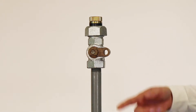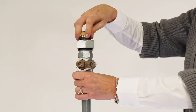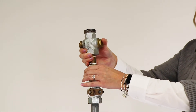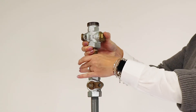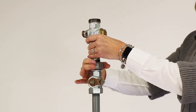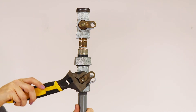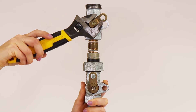Basically what you have here is your service riser — it's full of gas and the valve is in the closed position. We recommend that you take the insulated end piece of the nut off of the riser valve so you can take another valve — a sacrificial valve that you can use over and over again — which has the same type of insulated union nut as the riser valve. Simply thread it hand tight onto the outlet of the riser valve; you don't need any wrenches. At this point you've got gas flow to here, and both valves are closed. Open the riser valve completely so now you've got just a little bit of gas movement to here.